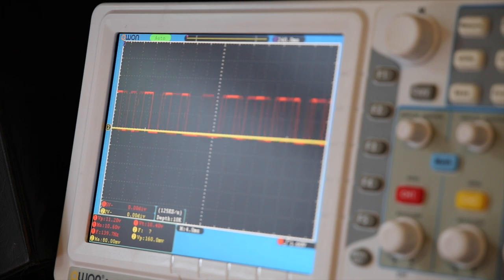The modification, as you can see on the oscilloscope, adds a pulse wave as an option, and the pulse width is variable. You can hear the pulse getting narrower and narrower. And since you now have variable pulse width, you can automate that. This is just a single oscillator from the GR300, not in duet mode, and you can see the waveform being modulated — so you now have pulse width modulation available in the GR300.